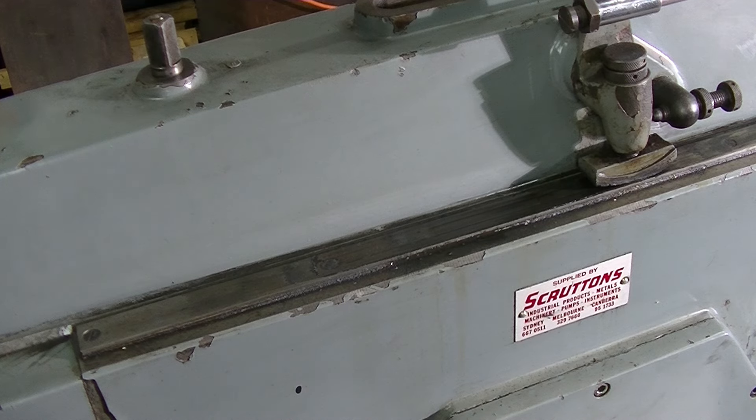I thought I'd bring you in on this side of the old shaper. It's a very rudimentary oiling system, just with a couple of metering blocks in the lines. At the top there is an adjustment - it's more of an overflow. It's not how much oil you put into the machine, it's how much you let go back to drain, and it's a very finicky adjustment. At the top here it just feeds out onto the ram and runs back down inside the guts of the machine. But I've got it set down close to zero, and you can see here that it's overflowed just in a minute, running all over the slide for the clapper retract. So I'm going to have to back the oil off, and in doing so just allow more down to drain. A reasonable system - there's not much to go wrong with it, in inverted bloody commas, unless you've got a shim-up spring under a bloody check valve.